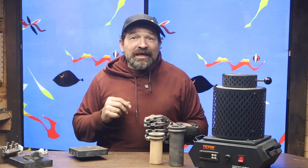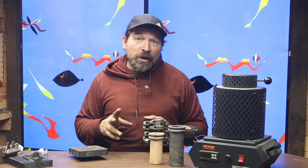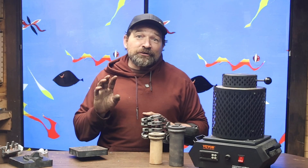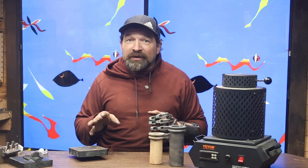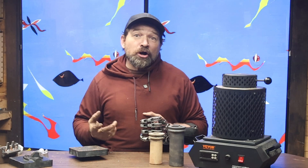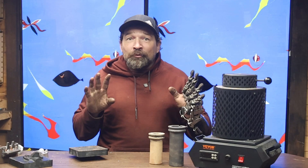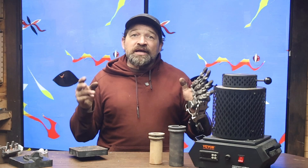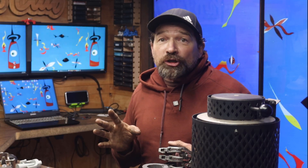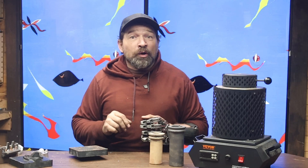The material that I've been using for these parts came from the cast aluminum housing of a hydraulic auger attachment for a bobcat. Aluminum is super porous, so when it comes to melting, you don't want to use any metal that has been in direct contact with oil — it's contaminated, going to smoke terribly, and generate a pile of slag. Avoid using transmission housings. Instead, look at using something like damaged car wheels — they're generally forged using a decent alloy and will usually give you pretty reliable results. Different types of aluminum will have different rates of flow and only be able to cast certain levels of detail. Generally, material that flows really well isn't going to be super strong, and likewise, harder material isn't likely to flow super free. A little experimentation, and you'll figure out what works best for what you're doing.